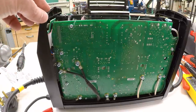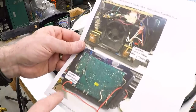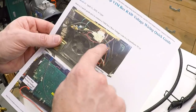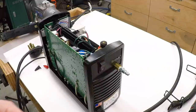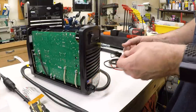I could solder onto those two rings, but I don't want to solder on this board, especially with the conformal coating on it. Instead, I'm going to tap into the wires using connectors from the Crossfire torch height controller kit. There's also a post in the Langmuir forums by a user showing photos confirming where the raw negative and positive voltage wires connect, and that the purple and orange are indeed the correct wires. I've verified everything individually myself since you never know if there's been a design change.